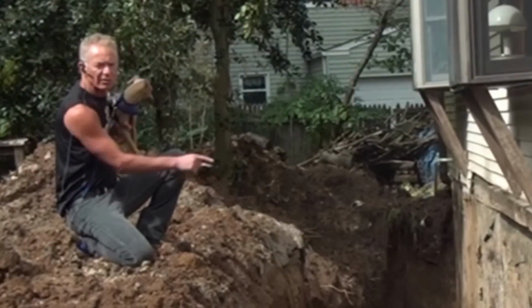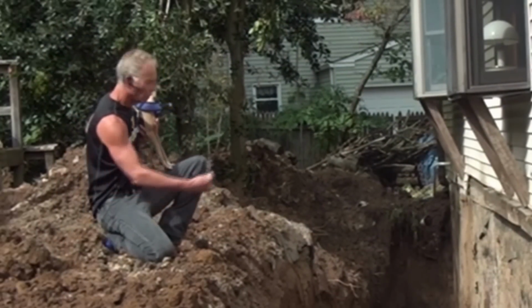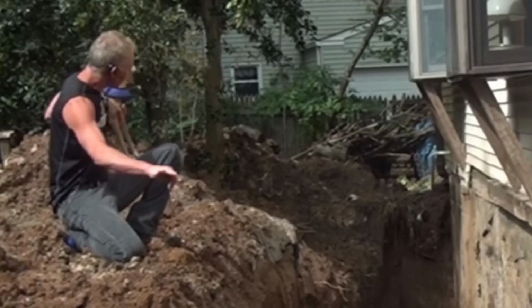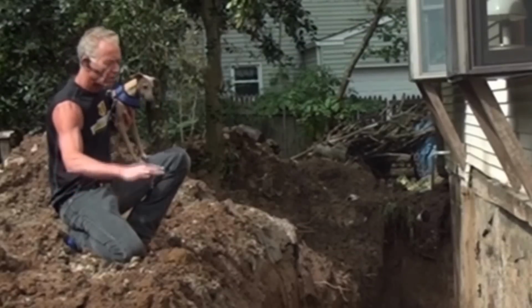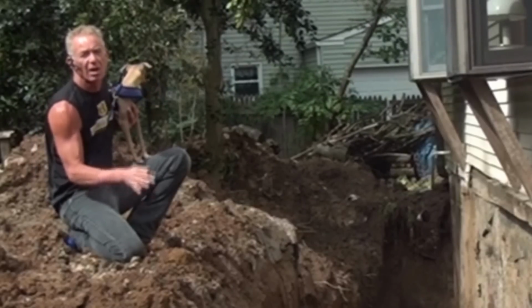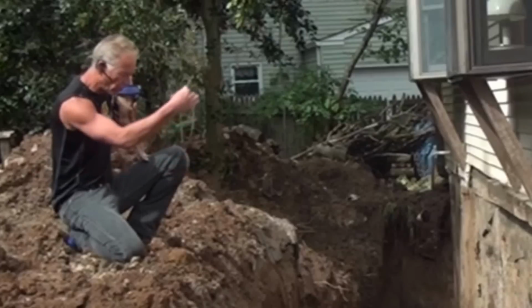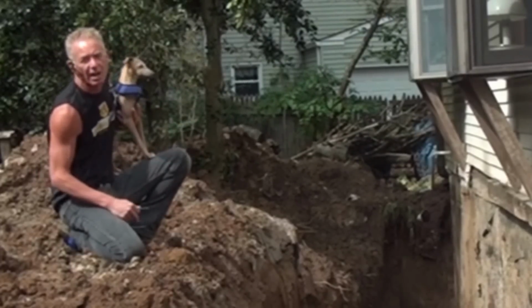Okay, so this is what we'll do. We'll excavate the outside of the home. We'll push the wall back. We'll install wall pins to keep it in place. And then on the outside, of course, we're going to do a real tight waterproofing job. We'll put a very thick tar, and then we put one solid sheet of 20 mil reinforced rubber all the way to the bottom of the footers, and water can never ever penetrate this wall.